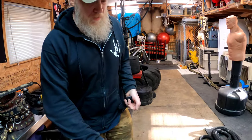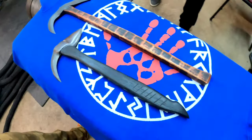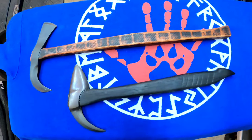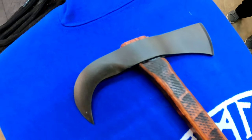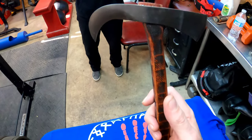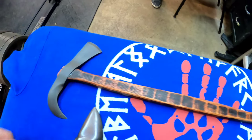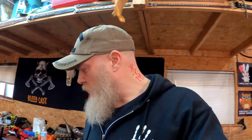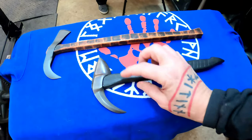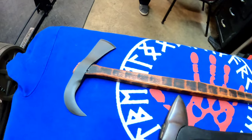Another thing he does that I really like is that the handles and wedges come from the same cut piece of wood. The advantage of that, as opposed to using a metal wedge or a wedge from a different type of wood, is that as the wood swells and contracts with the weather, the wedge in the handle will do that at the same time — and it will prevent it from becoming loose.